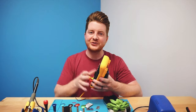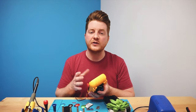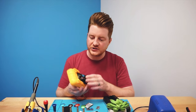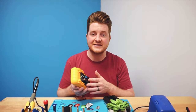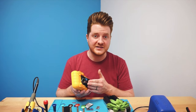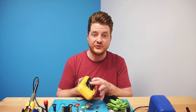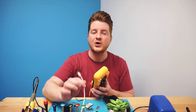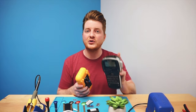Here in front of me I have my trusty multimeter that I've been using for the past couple years. It used 9 volt batteries until about a year ago when I converted it to use a ZTE cell phone battery from an old flip phone that was basically discarded. I pulled it out, it still had decent voltage, so I got a charging board and a voltage booster, wired it all up, and now I have a rechargeable multimeter I can plug in with micro USB. Today I'm going to do the same thing to my Dymo label maker.